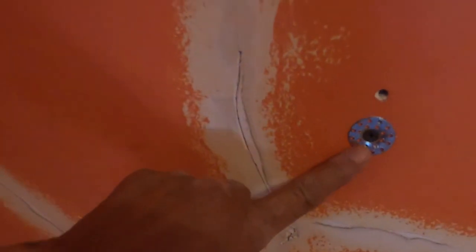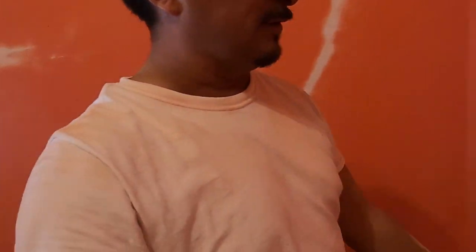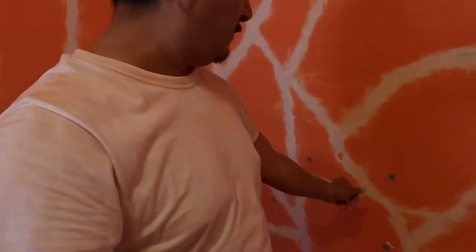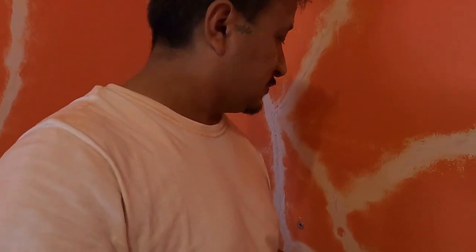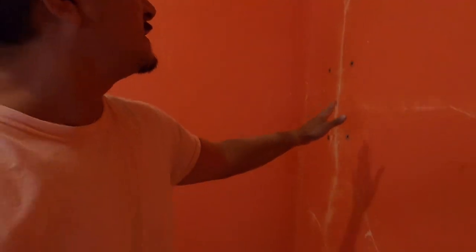All this loose plaster now has the plaster washers holding everything in place. My next step is joint compound — I'm going to tape everything right now. With these plaster washers, I'll use a little paint-and-body hammer to make sure they're hammered flat. They've got teeth that stick in, but I'm going to make sure they're silky smooth before I start taping.